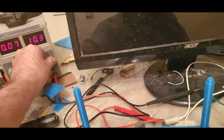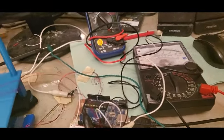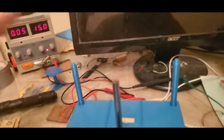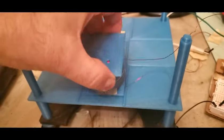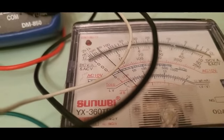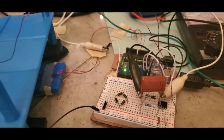Okay, let's spin it up again, and I want to show you one other thing. So we'll give it a minute to spin up. And this time what we're going to do is look at amp draw when we turn that thing down to 0. Okay, I think that's fast enough. Now, turn this to 0. If you can see, it's trying to go negative. Now, you might say, oh, no, you're not. All right. How about this? Now, see what the amp draw is doing? So that amp draws that way. Now, do this. And it's not made to show negative, but it's below 0.